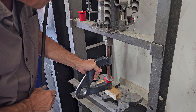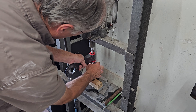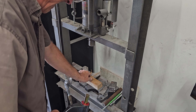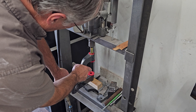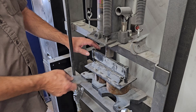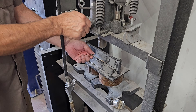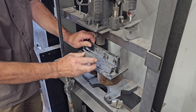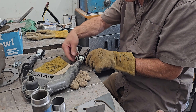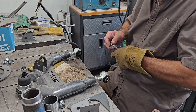To start off with, we're going to go back and show you some old footage of some of the suspension pieces just to give you an idea of what was going on — to get to the point of being able to have something to attach all these hubs to. These pieces all built up, we need to put some bushings into them. Hydraulic press, Harbor Freight Special — it works really great for doing a lot of things. You're going to see me use it here in a couple different ways: as a press just like it was made for, and then with little cast iron chunks used as a press brake. These are little corner pieces of the pickup points — they would call them in racing — parts that attach to the frame of the chassis to hold our suspension.